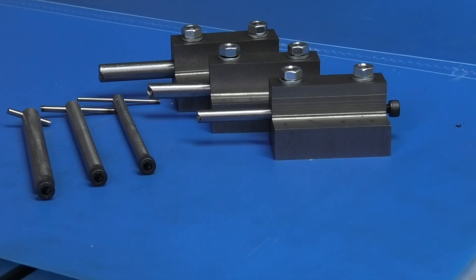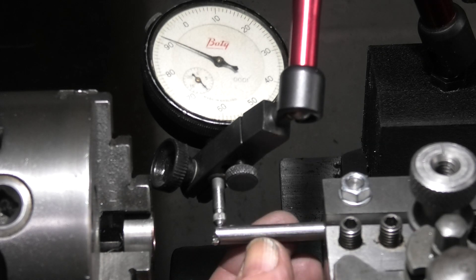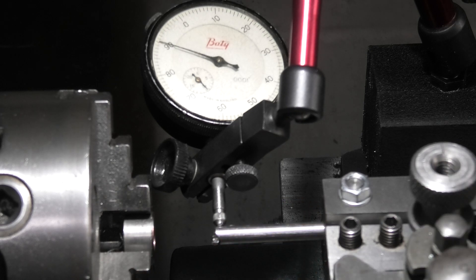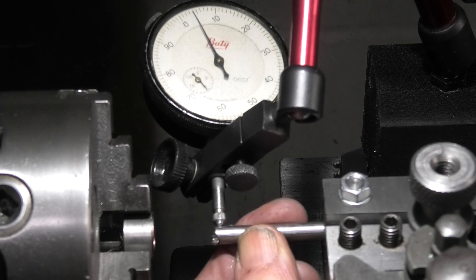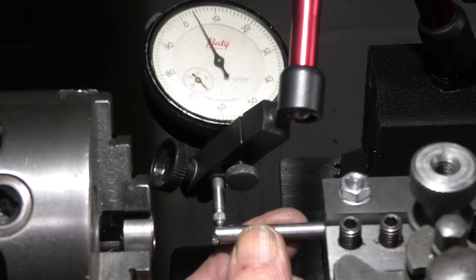To finish the boring bar kit: we have three boring bars fitted in the blocks and three thread-cutting bars, but I haven't finished the tooling for those — I'll grind those when I know what type of thread I'm going to cut next. I've fitted the new boring bar into the tool post and set the tool to centre height. I'll put the dial indicator on the end — I just want to see how much flex is in this bar. As you can see, that's a thou between zero and 90 degrees. But that's without the tension on — if I tighten the tension up by turning the cap on the end, that pushes the bar through the middle and tightens the tool up as well. You can see the indicator moving. To get a thou you have to really push hard on that bar — it's stiffened up. Tighten it a bit more — yes, it's stiffened up that bar to stop it moving.